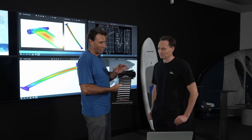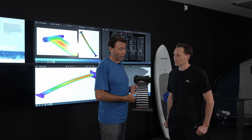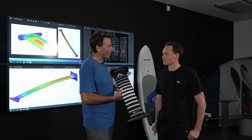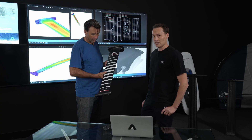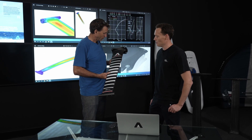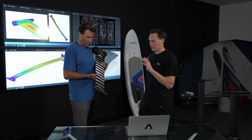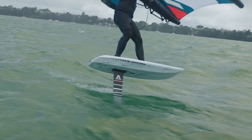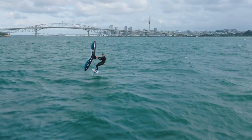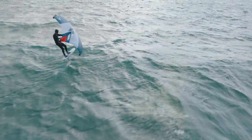The sectional shape is really a key thing — everyone has their own take on sections, but there are definitely some key people out there who are just the world experts, and that's who we managed to tap into. A lot of the R&D came from the last America's Cup — three years of technology analysing sections from all sorts of foils — and we honed in on three sections to develop a really robust section that could cover the range, with low drag, forgiveness through a wide range of angles, and a wide cavitation bucket.